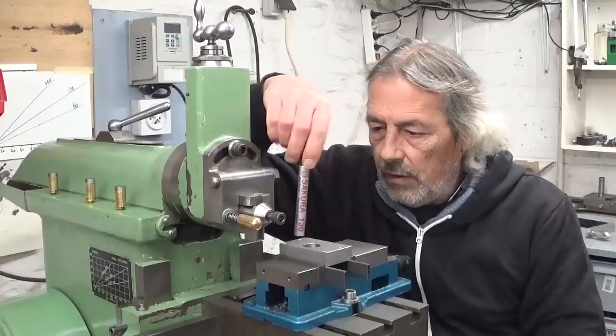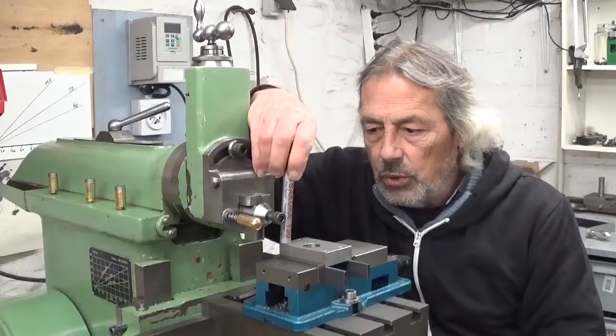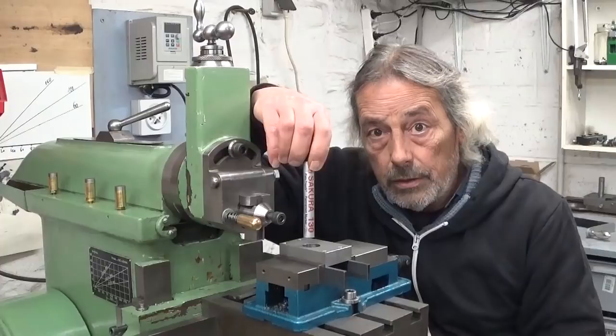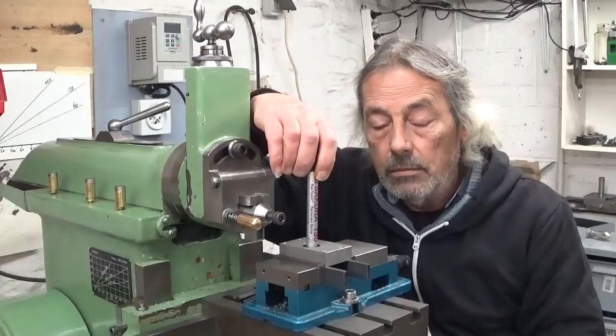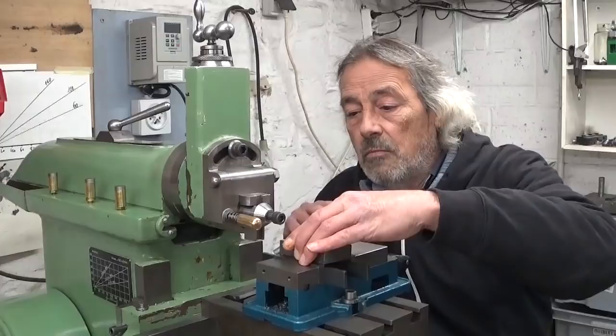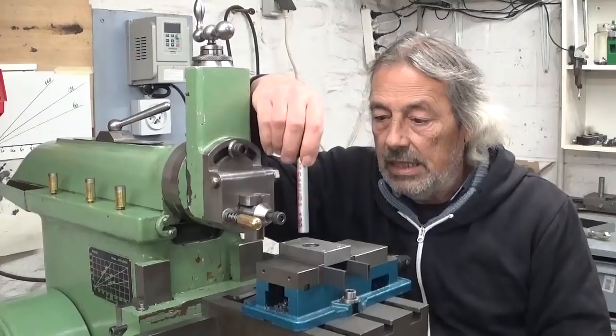Take your cutting tool out, drill 4 holes, and then drill the 5th hole. And with the boring tool, I don't know what you call it, you can make the big opening all in one setup. If that's finished, take your part out, flip it around like this in the vise, and you can do the contours again and this face in one setup.